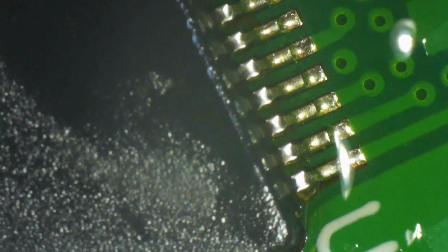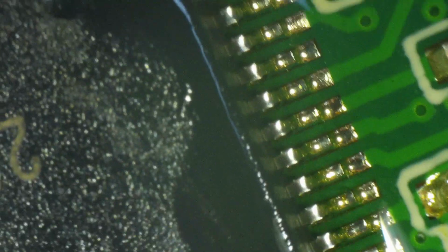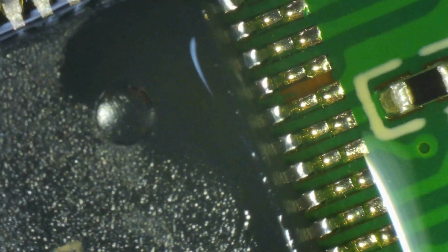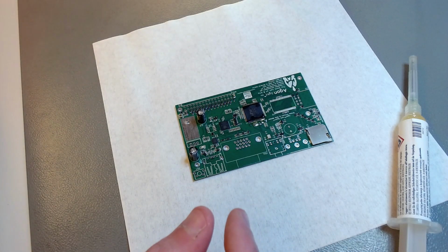That's it. No solder wick. You will get these shorts regularly, and this is the way to remove them. Just clean the tip and pull out the blob. And then we inspect with the melted solder, the melted flux paste, to reduce the glare. We inspect that everything is soldered and there are no short circuits.